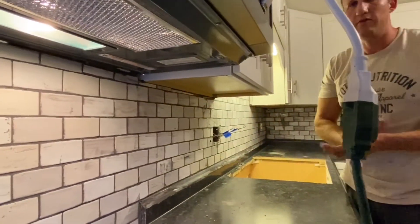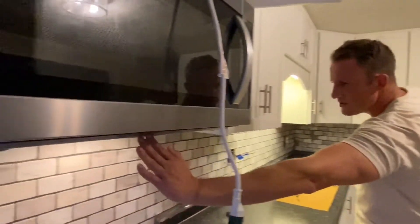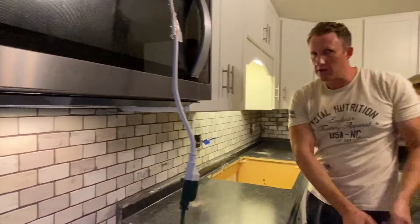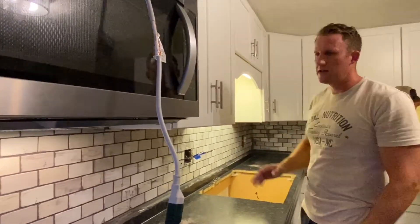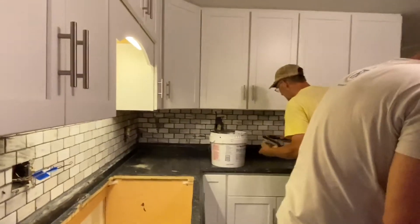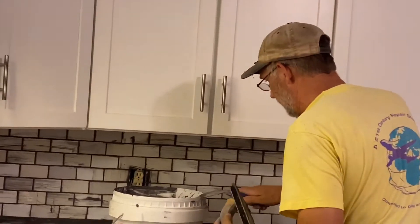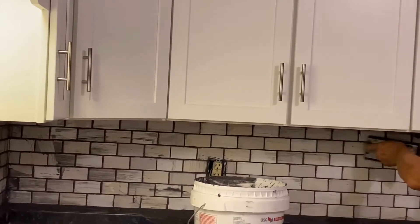You wipe it, then you get a clean sponge and slowly wipe with the clean sponge at a diagonal. I just do one pass like that, then clean it out, wring it out really good, do one pass — and you just keep doing that process until it gets perfectly clean. Then let it sit when you've got your joints and all the excess off the face of the tile.